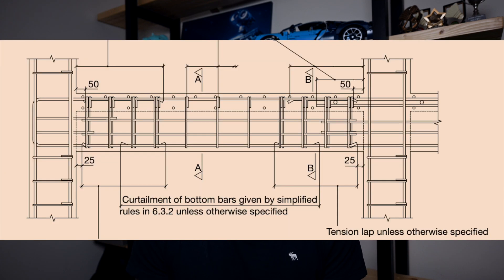A concrete beam is slightly harder to tell from the outside because it all looks the same — it's just concrete. What determines whether a beam is a fixed or simple connection comes down to the reinforcement detailing. Generally in concrete beam design, you'll have what we call U-bars at the end of the beams, and if those U-bars are fixed into a column or wall, this will generally be a simple connection. There are cases when U-bars can transfer a little bit of moment, but generally if you just see U-bars in a beam you assume it's simply supported.